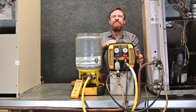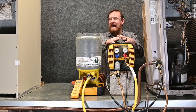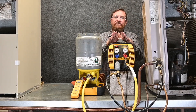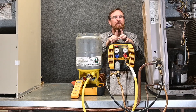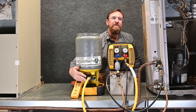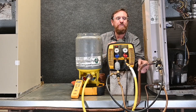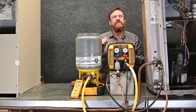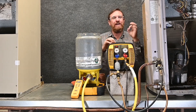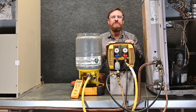We were also able to pull the liquid refrigerant out first, which made that go a lot faster. Now, other things we can do to speed it up even more: the first is to make sure we use larger hoses. Just like I use a large hose going into my recovery tank, I want two more of those hoses coming from the unit to the recovery machine — short, thick, fat hoses, as short as possible, with a large diameter, so we can pull straight from both sides.